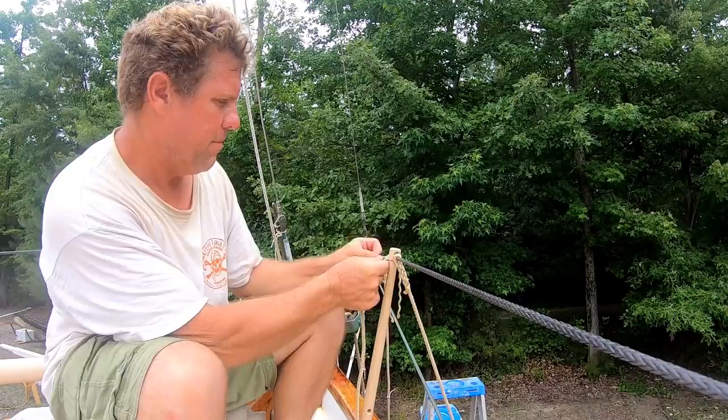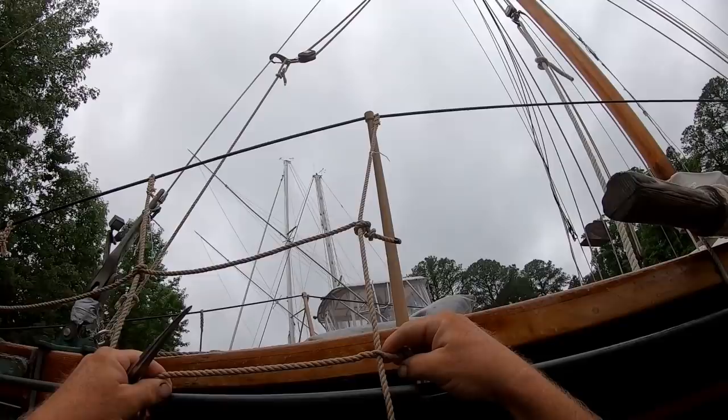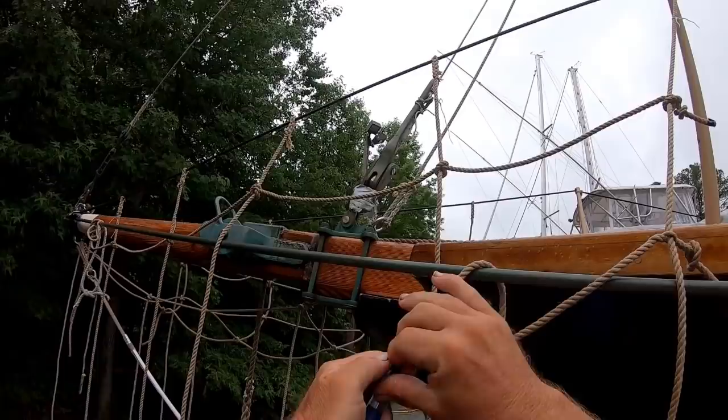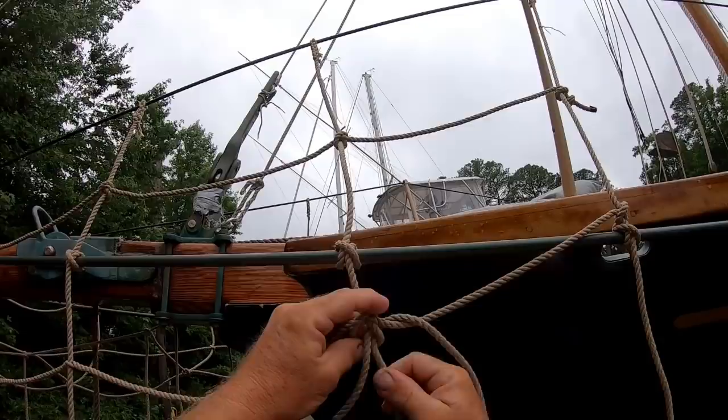And finally, I want to add cargo netting beneath the bowsprit. This acts as a big net which I can lower the jib down into, and it prevents the jib from falling down between the bowsprit and the whisker stays, and potentially getting dragged under the boat. And once again, I turned to instructional videos on YouTube on how to create cargo netting, as this is something I had not done before.